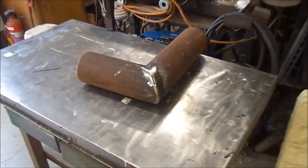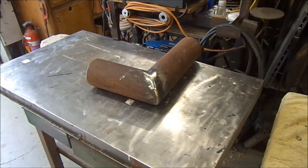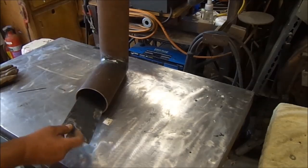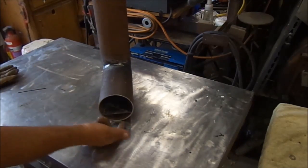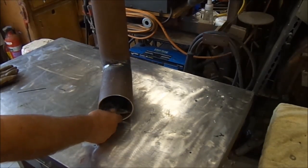It's all dressed out, so let's add some legs to this puppy. We also need to put a chamber divider in there so the cool air can go in the bottom and the fuel can go in the top. That'll be next, along with the legs and a three-part holder on the top — a three-way holder. Don't want to go four in case you're a little off; if you go three, it'll always be level. Now, this divider is what makes these things so effective. It allows the air to go in the bottom — you put your little twigs in the top and it burns, just pulling that air from the bottom. That's why they're so efficient.